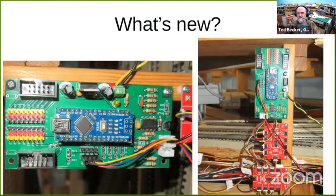These are 2 of those I2C multiplexer boards that in essence create individual I2C buses. All this cabling connects to them, and all the detectors for the fouling point and those turnout clearance points are scaled engineering I2C IR sensors. They're not the full train spotter. They're just the infrared sensor on a little board, and you access them through I2C.